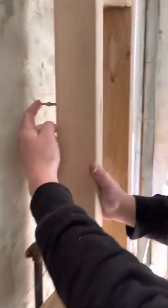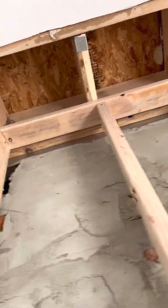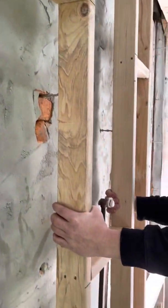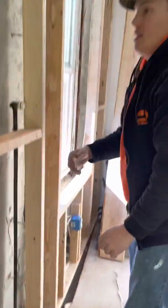My brother-in-law Vinnie is out there getting ready to drill the ties. You can see them right here — we framed this wall and put blocking up there. The wall actually fell in between two joists, so we added blocking, put hangers on each side, and now our structural wall gets attached to that — tied in to the top joist and tied in with the bottom plate at the bottom.